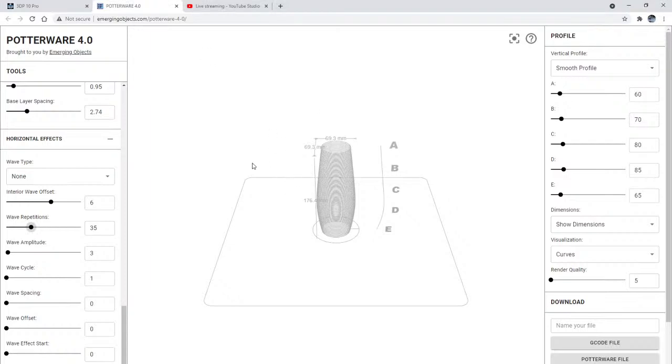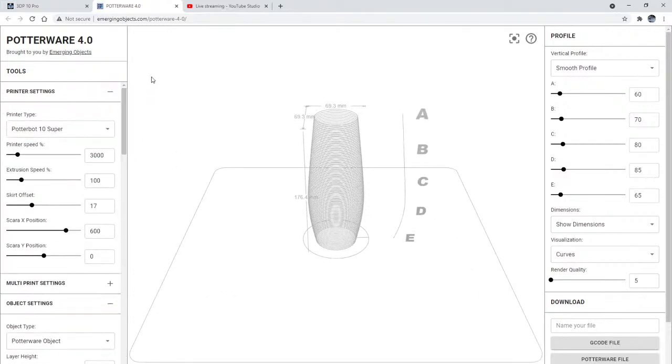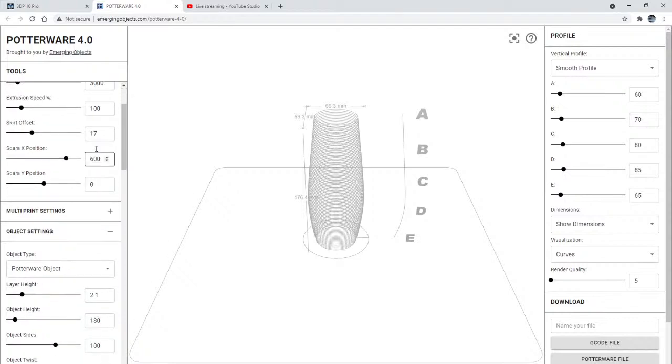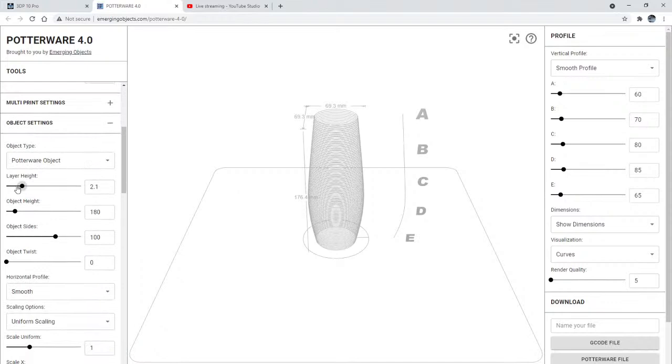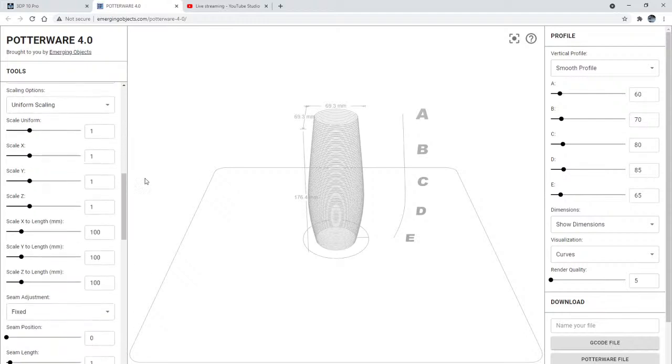All right, so this is just a simple object we're going to do. This is Potterware from Emerging Objects, and I think we have a link in the description. We're going to select our printer here, which is Potterbot 10 Super, and the speeds are set. They work relatively well out of the box. Coming down, layer height is 2.1, object height is 181, and then we can manipulate the size and shape over here. Extremely easy.